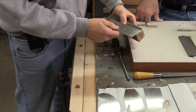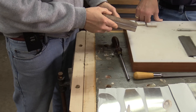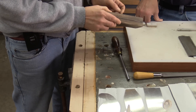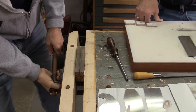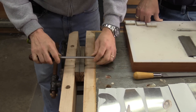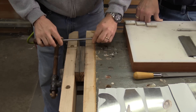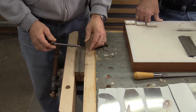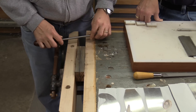Now we've got those edges polished. We're going to take this block and put it back in here, leaving maybe a sixteenth to a thirty-second of an inch on top. We're going to put it in our vise and clamp it down. Then we're going to take the burnishing tool again and go across the top with the same light pressure — just go flat across the top. It only takes about four to six times; you don't have to beat it back and forth.